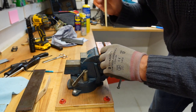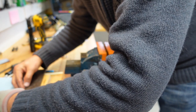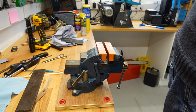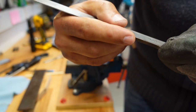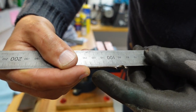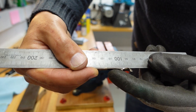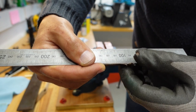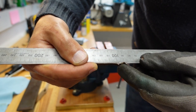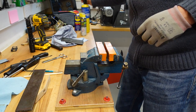Let's bring you back open. Let's see where we are. And that actually looks a lot better. So we are now somewhere near straight, but I don't think that's enough yet. I want to give it a bit of a positive bow forward, because I'm going to have to overstretch it the other way again just to get it back into the bolt face. So we'll do this again.